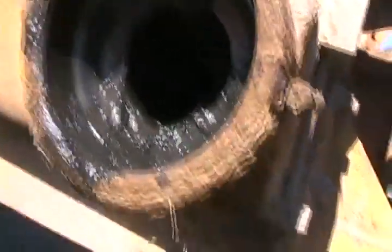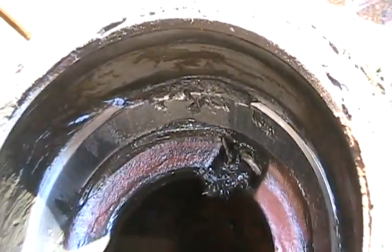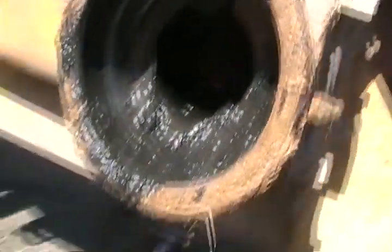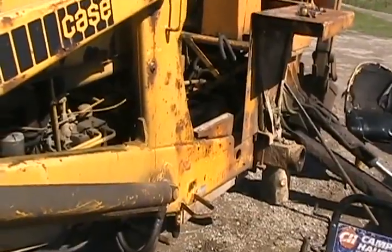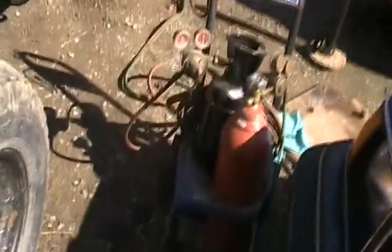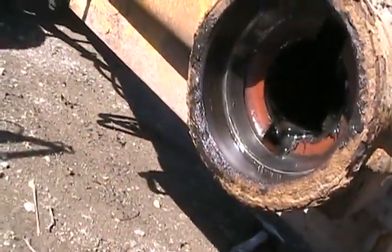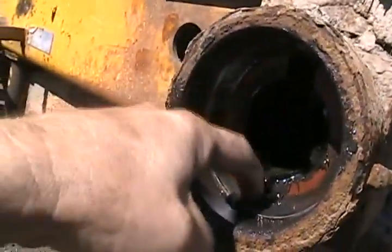We'll have to clean a little grease off first. Well, it sure is a good thing we took her apart — oh my god, look at that bearing. It's almost completely severed from wear. Good thing. I've got to remember that grease fitting — it'll look so rusty I might even have to change it. Oh well, 1974 — it's been a long time since those new bearings were in there. So how do you remove a bearing in a blind hole? Well, you're supposed to knock it out from the other side with long drift pins, but I'm not going to pull that whole axle assembly housing out. So I'm going to slit it with a cutting torch like I usually do — that takes all the tension off of it. I use an extremely hot flame so it heats up the bearing quicker than it heats up the cast iron around, and cast iron barely cuts with the cutting torch anyway. I just cut a slit in it.